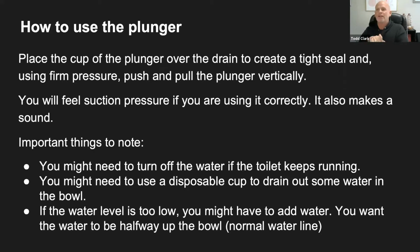But that's a great question, because even our children asked, Dad, our toilet's not working properly, it keeps running. So if you take the lid off the back, and if it's something that continually happens, you might have to adjust the chain, or there could be some kind of plastic rope, and you might have to adjust that to make it so that your toilet isn't continually flushing.